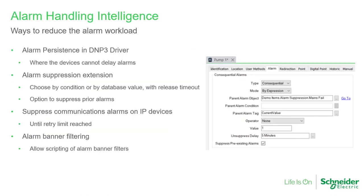Managing alarms, particularly in large systems, is important to control the costs of field activities. Almost universally, our customers have too many alarms to handle, and we constantly seek new ways to filter, reduce, and display alarms more effectively. Four new features have been added for alarm management. The first is a persistence, or alarm-raised delay, added to the DNP3 driver. By calculating persistence in the driver, the load on the database server is reduced, and this is useful where the RTU does not calculate persistence itself, unlike WITS or SCADA-PAC devices which don't need this.